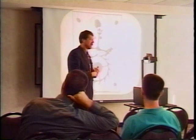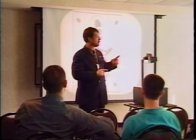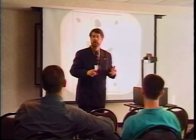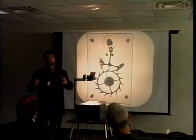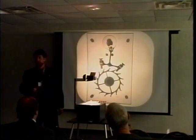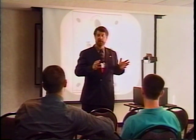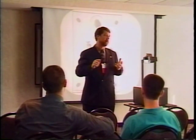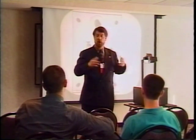If you've taken any of the watch certification exams, there are some questions pertaining to if you push the R stone in, what effect does that have on the drop lock or the total lock on the L stone? Does it increase it, decrease it, the slide, whatever. They want to know what it could do. And it really bothers me because the way I understand the escapement, all that stuff takes place automatically. If you have your equal fork horn clearance, your equal guard pin clearance, your equal total lock and safe total lock, drop lock, slide, total lock all take place automatically.